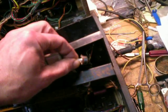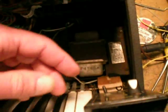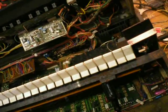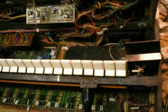For right now, I just wanted to show you the beauty of this thing. If you pull the little switch out and put that in — I'm just going to probably RTV-goop that in there and put a knob on it. Now we've got a coarse and fine control sticking out the front panel rather than a switch, which doesn't even really connect. It's one meg, so you jump from 100K to one meg and it jumps up to like three to three-and-a-half seconds. This way you've got a continuum and you can select any precise glide rate from very fast all the way up.